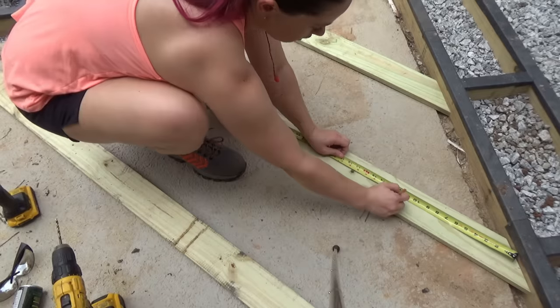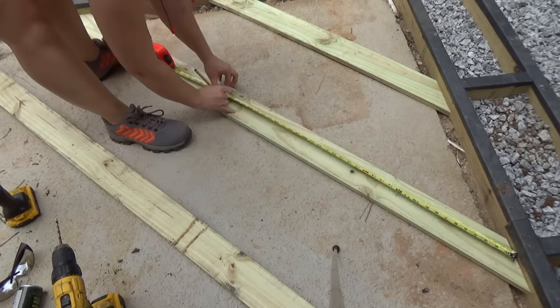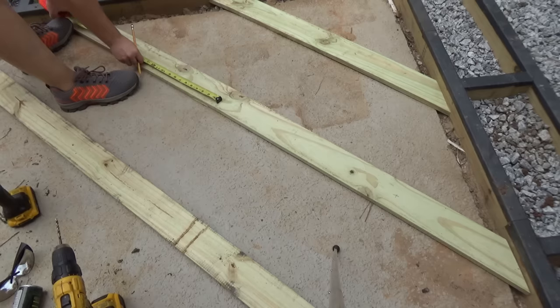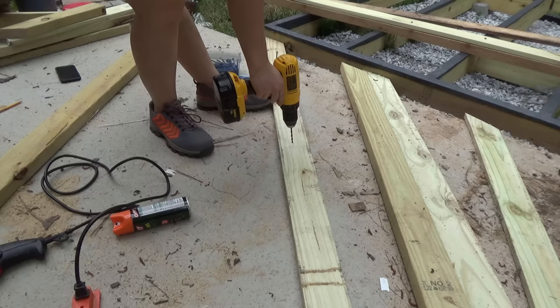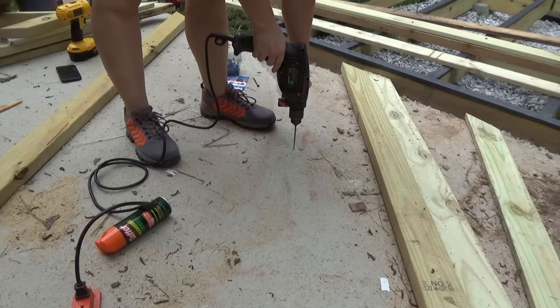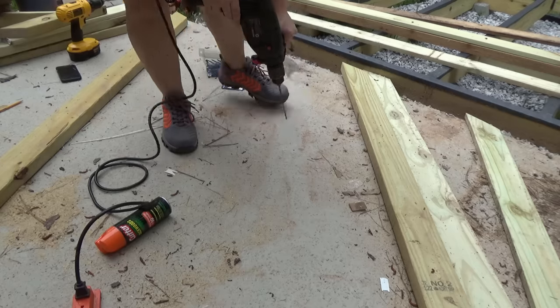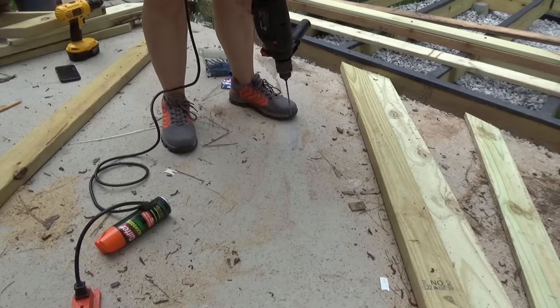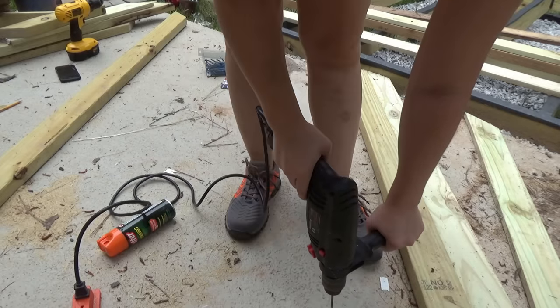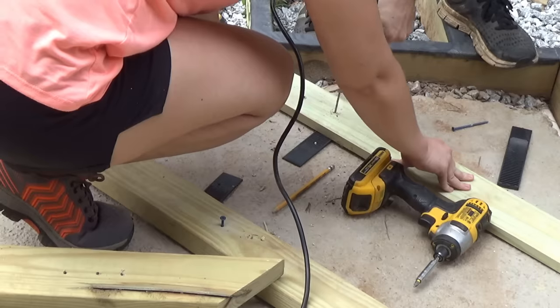Using a hammer drill and a specialty bit, I spaced each hole about 2 feet apart and kept going for each board. It takes a little trial and error, but I found that the easiest way was to pre-drill through the 1x4 with a normal bit, then use the hole to line up the hammer drill. Be patient and do a little at a time. Also, drill slightly deeper than the screw will need to go, so that any dust remaining at the bottom of the hole won't prevent you from securing fully.